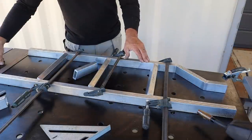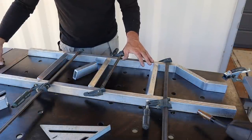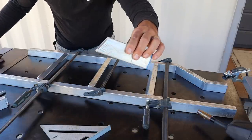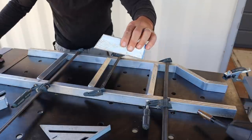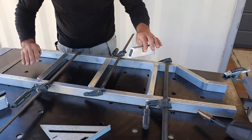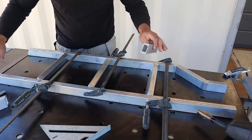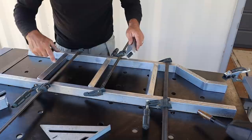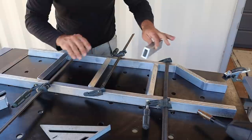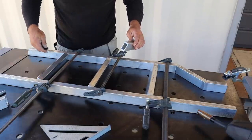I've got everything clamped down and ready to tack into place, and I'll be honest — this was probably the most difficult part of this whole project so far. Each of these steps I tried to put that same 22 and a half degree angle that I have on the bottom of the legs, so they can be relatively flat when I step up into the tailgate. I squared it basically every way I could. I'm going to get the spool gun and tack these, starting on this side because it's going to be the bottom side — so if some of my settings are off it shouldn't matter, I can get them dialed in before I do the top side.